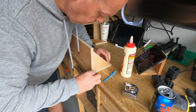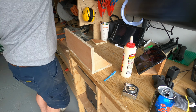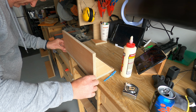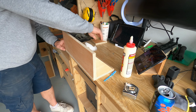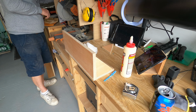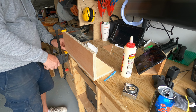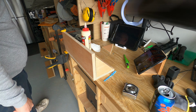So when I got them in place, I just got some 40mm brad nails and pinned them in. 40mm might sound like a lot, but I wanted to get this as strong as I could, and the rigidity was really, really important. So I put them into the gun, my airstrike gun, and popped them in after I'd clamped.